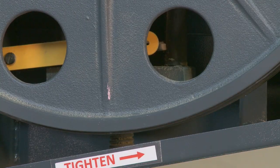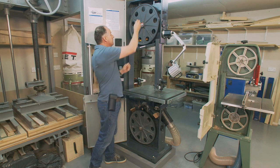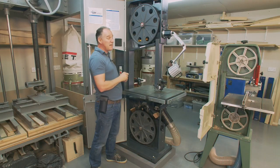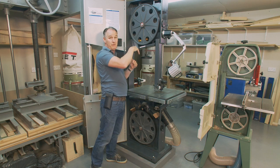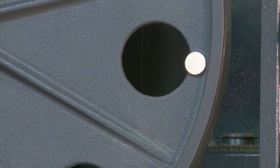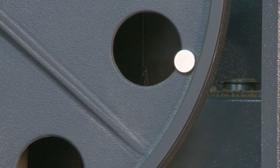If that was a heavy spot, I could potentially put a counterbalance weight at the top. The bigger the weight and the further the weight is out from the center point, the more it will make the wheel come down and hopefully balance the other way. So be very cautious about drilling holes in your bandsaw wheel.